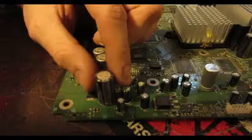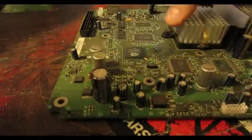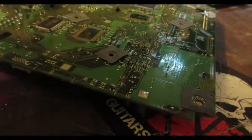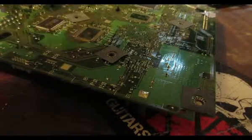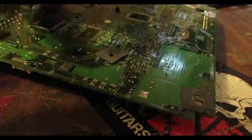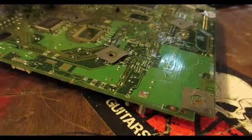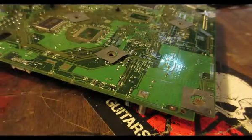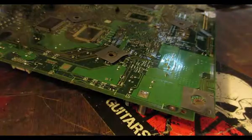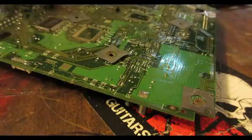The top of it is marked blue here, as you can see. We'll go ahead and flip it over — it's going to be those two points right here, one and two. I usually start off using a solder sucker and then use the desoldering braid. Go ahead and turn your iron on and warm it up.